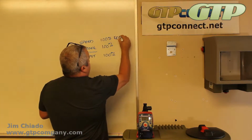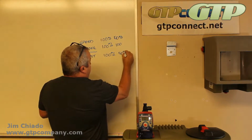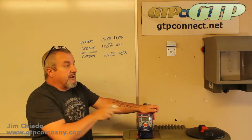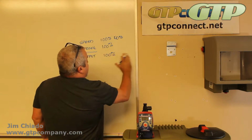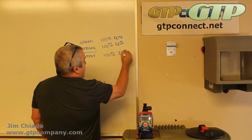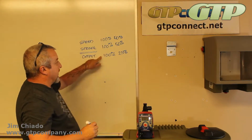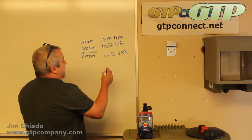So 50% and 100, you get 50%, right? Either 50% speed or 50% stroke is only going to give you 50% of the output. You've already turned it down half. So let's say we do this again, 50%, 50%, 25%. You've turned speed half, stroke half, now I'm going to give you a quarter of the output. Pretty simple.